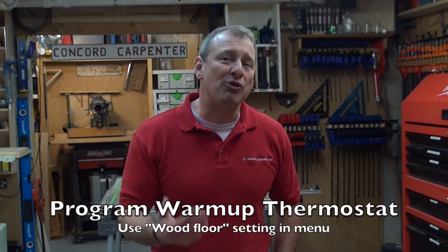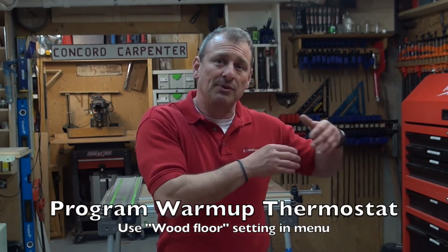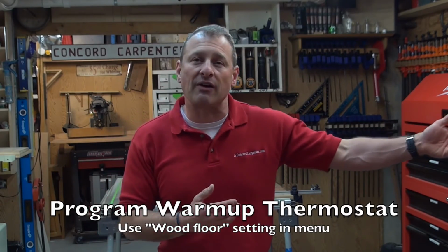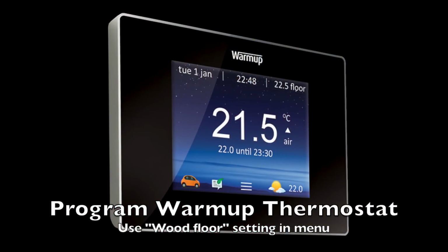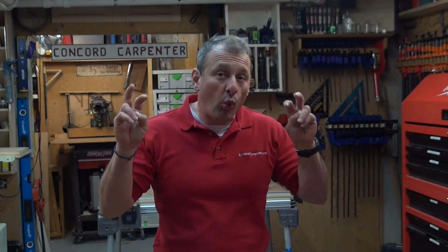Step 10 is program your thermostat. And you want to program it so that it doesn't reach a maximum of 81 degrees Fahrenheit to avoid drying the wood out or causing warping. The new Warmup 4IE Smart Wi-Fi thermostat does this automatically for you when you select the wood floor in the menu. I think it's brilliant. It does it automatically for you.